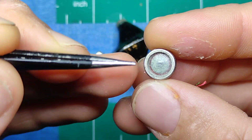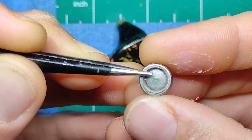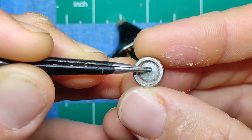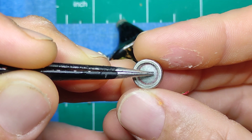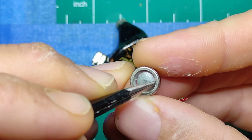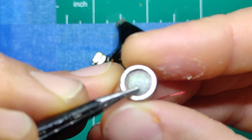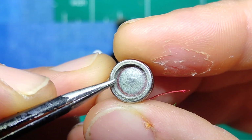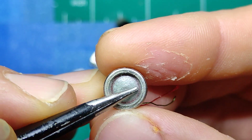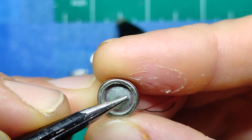And what you'll notice is there'll be changes in pressure. So as the pressure changes, sometimes you'll get bass, and then bass will go away, and then it'll come back again. It's because you're deforming the diaphragm enough that it allows it to move within the gap of the magnet. It allows the voice coil to move within the gap of the magnet. Come on. So you might even notice it looks like it's kind of off, like it's at an angle. Yeah, there we go.